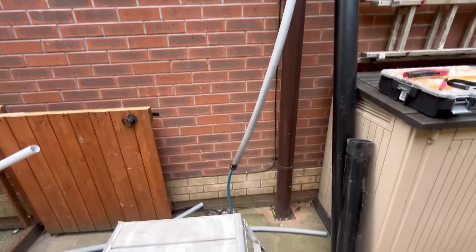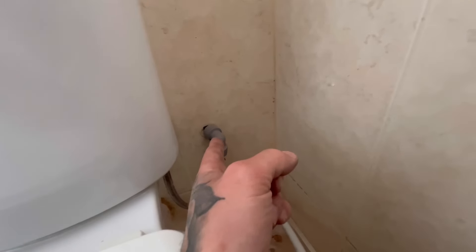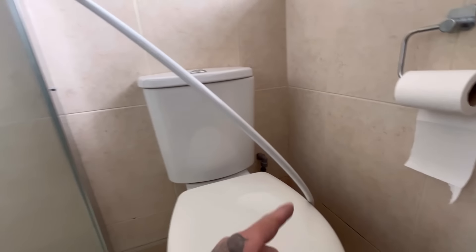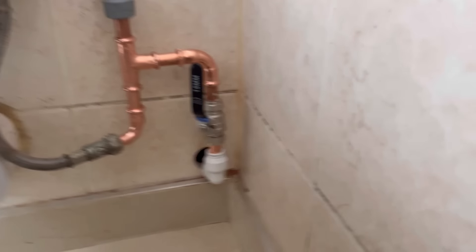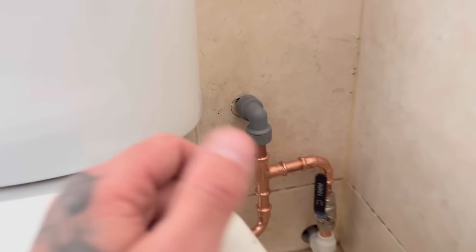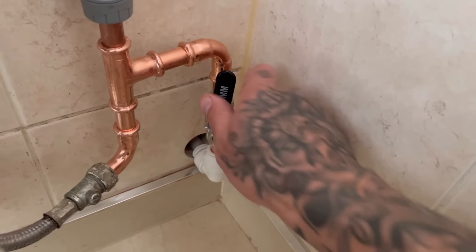You can only work with what you've got. This is where they'll shut it off in the winter. Customers always do that - it's just a risk. So you don't risk bursting any pipes in frosty conditions. That's just done. Inside here, believe it or not, that and this is not the outside wall - there's a cupboard but you can't get to the back of it. And just like that, that is just done - it's insulated through there. The 15mm Speed Fit goes in there and that's where they'll shut it off in the winter.